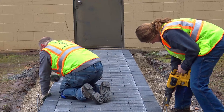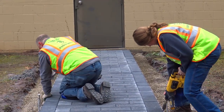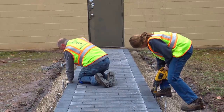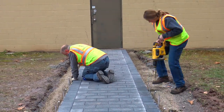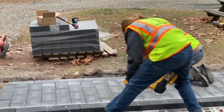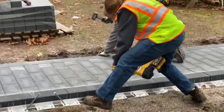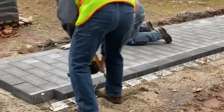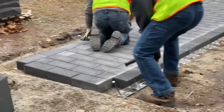These are solid connections into the earth as opposed to, say you're gonna use a concrete that's only biting into your top half inch or 3/4 inch at the most, and that's all it has connection to is that top surface. So a system like this, again, ICPI approved, has much more holding power for lateral shift.